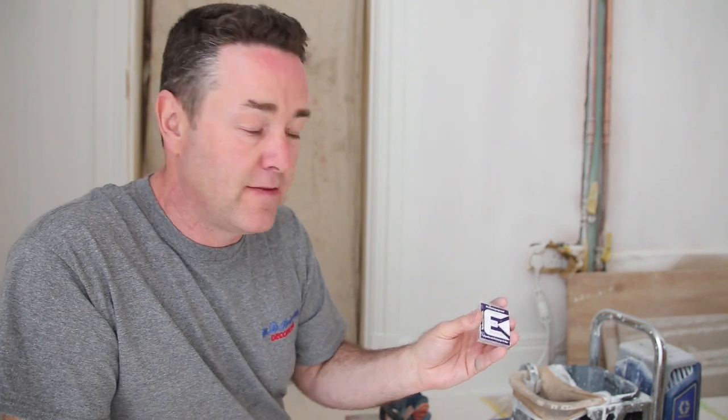So it's just push it through, just twist it around, both ends, one side, then the other, and then you can try and flush it through with some more water on the pressure of your spray gun. Not too much pressure, you're not wanting to spray at 2,000, you're just probably 700-800 PSI just for flushing your tip out.